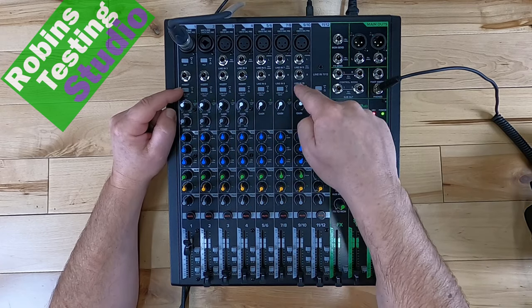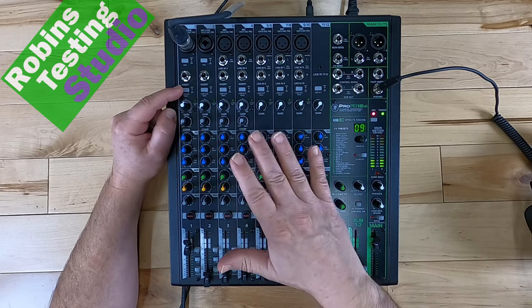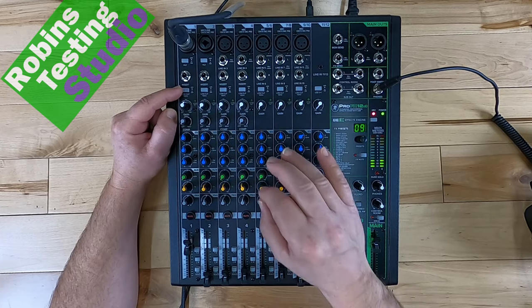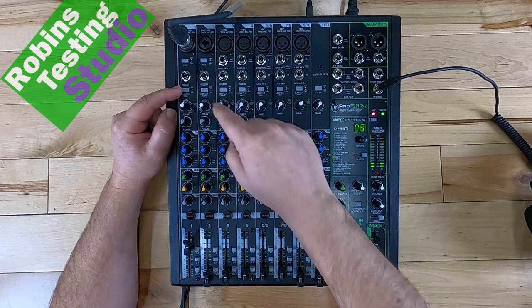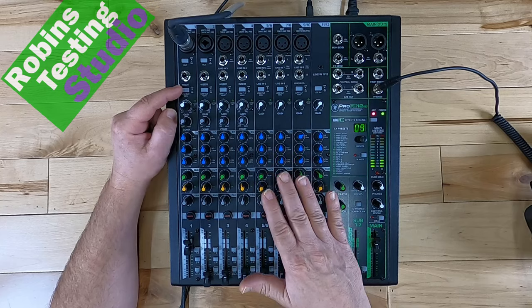Below that, across the entire board, you have a low cut, which is going to get rid of the bottom end. So if you're using it primarily for talk, podcasts, that sort of thing, or videos like we're doing here, you can get rid of the low background noise. Because even in this showroom, I can't control the air conditioning and heating ductwork from generating that kind of noise. This is going to cut that out for you, as long as it's at 100 Hz or less.